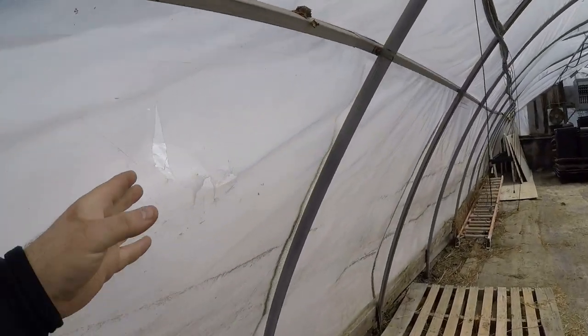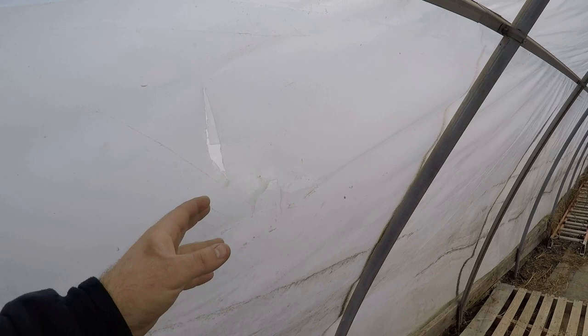As Dad was in this greenhouse watering, I was looking around and I noticed some pretty large holes in this plastic, and I already kind of patched this one. There's this one here I gotta fix, and this one here. We have some plastic that just goes over top of them and seals them up. We need to do that because these holes let in a lot of air from the outside, and at nighttime, when it's like 30, 40 degrees and we have the heaters on in this greenhouse, we'll be wasting a lot of money because of that.